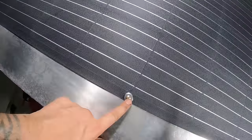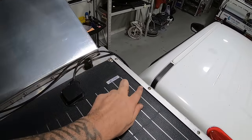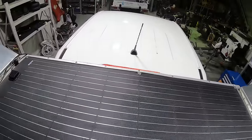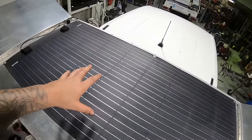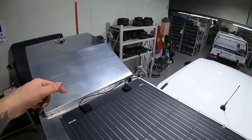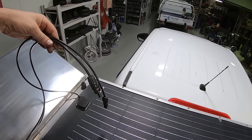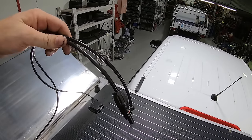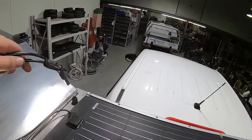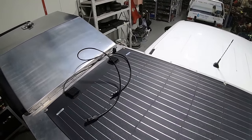That's the whole solar panel done. We've got screws and big washers in the bottom section, and in the top section we've got screws and big washers plus an aluminium bar running across the whole thing with screws and washers in every eyelet. This thing should not go anywhere — I'll be very surprised if it comes off. The old one's been frisbeed into the drain. Next step is getting these wires down. I'm going to have to chop them off — and like I said, be very careful chopping these. Don't chop them at the same time; there's probably a little bit of voltage coming off the panel even now.